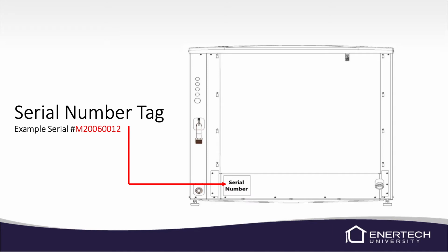So let's say the serial number was M20060012. The M, again, Mitchell, the 20 is going to be the year, so it's built in 2020. And the next is going to be your month. So the 06 would represent June. So it would be built in June of 2020. The 4 digits after that are the day it was built, and it's a resetting number, and you don't really have to worry about that. Just worry about the first 4 numbers there.